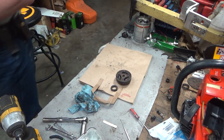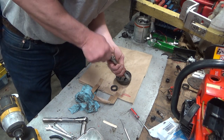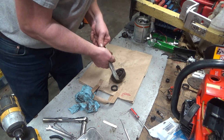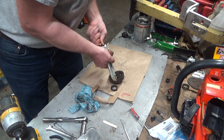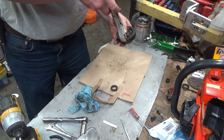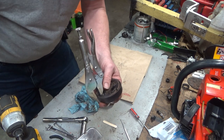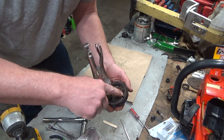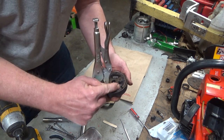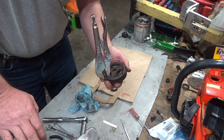My thought is I could then clamp it using the vise grips, similar to what I was doing before. I think this would work. I clamped it to the outside edge and do it on both, and then just cook the vise grips with it. You've got to have more than one set — I've got four total. In theory, if you did one on each corner, you could do every single clutch shoe all at once if all three were loose. And by clamping it in like this, it would prevent it from lifting at the edge. I honestly didn't think that friction material would lift like that, but it did. Live and learn.